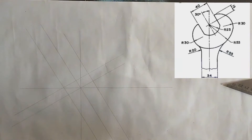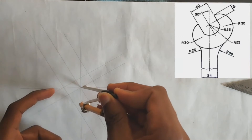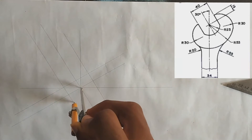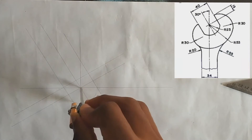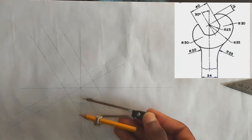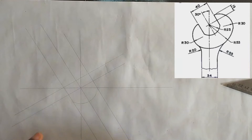What we are going to be doing next: from our midpoint we pick radius 23 on our compass. We put it at the middle, then we draw this arc using thin lines — make sure it's in thin lines. We draw our radius 23, that's this place we can see on the diagram.